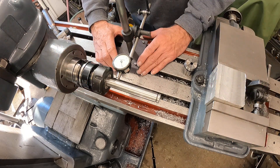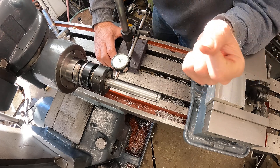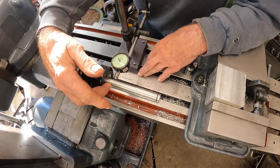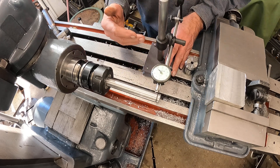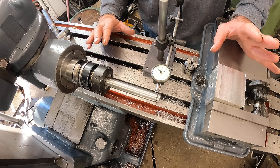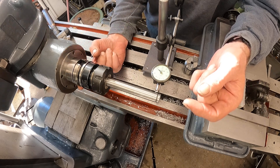The first time I showed this was putting burrs in Cleco die grinders and getting them to run true - it's the same kind of thing here. What's going on is we've got some problem with the spindle nose. I can get it to run true here but it's running three thousandths out further along. What I'm going to do is true it up, then take another test cut on this block to see what it looks like with it all tramped in as best it can be. Then we're going to find out why this collet chuck runs out - we'll start working on this spindle nose.